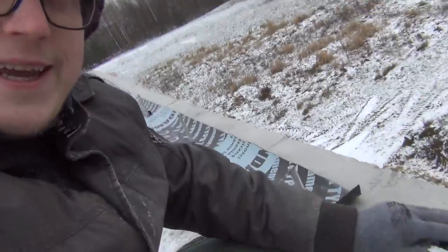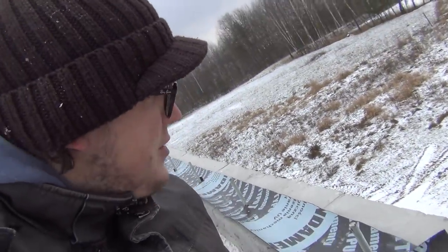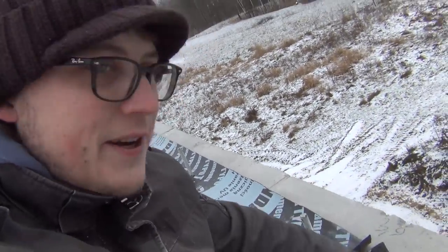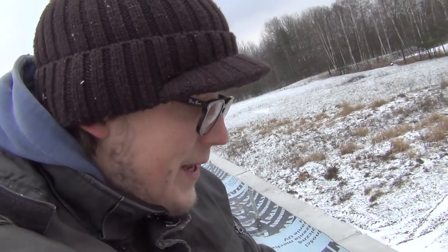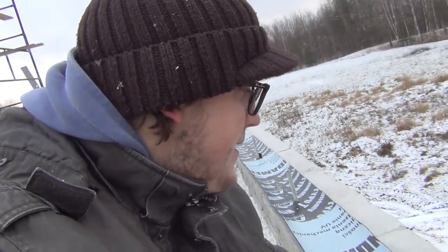And yeah, we're using a tar paper, like a reinforced tar paper for a foundation, really thick and nice stuff, to separate the concrete from the wood, so that if the concrete draws some water, it doesn't put it back into the beam and rot it out or something. Some people say unnecessary, because the concrete will extract the water from the wood the other direction. Some people say necessary. It's hard to judge, but we're putting it in. So, yeah, should be good.